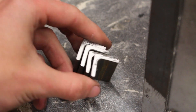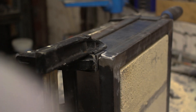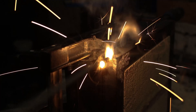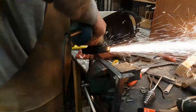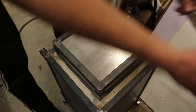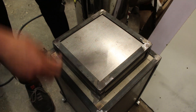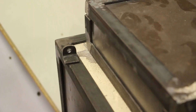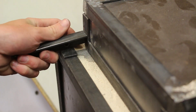I cut shorter bits of angle steel which are going to cover up the corners and then I weld them on. I'm only going to weld them onto one side so I can still take apart the frame because I'm going to need to paint it later on. I also cut some more pieces of angle steel which are going to be for forming the hinge of the door. These need to be welded onto the door and onto the frame. I make sure that the door is in the position that I want it to be in when it's closed and then I measured up what pieces of angle steel I needed to cut and then I drilled the holes.